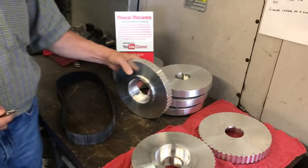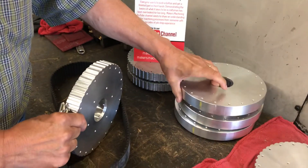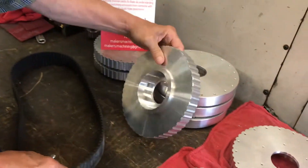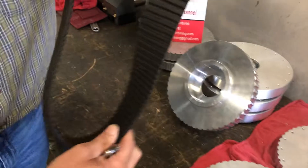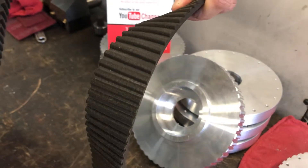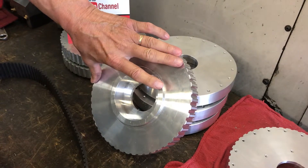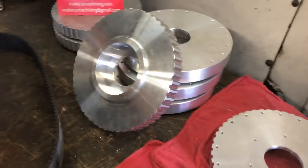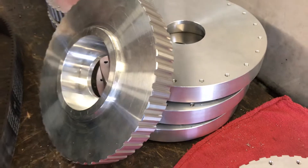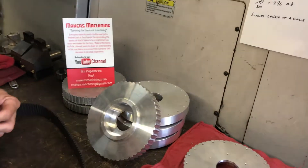We've got some pulleys that we're machining the teeth on here. You can see we're starting out with a blank that's already turned and a bunch of tapped holes are put in there. We're going to add the teeth for a timing belt. The timing belt is a rubber belt with teeth in it — it's quieter than a chain and sprocket, but does the same purpose. This is a 50-tooth timing gear. You might have a smaller one that's 20 tooth or a bigger one. It's just like setting up the ratio of sprockets like you have on a bicycle, but this is for machinery. You'll see a lot of these timing belts in industry and machinery today.